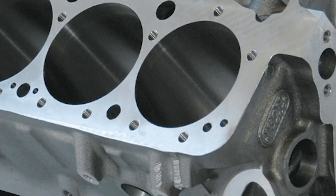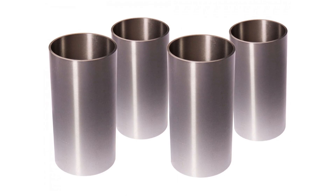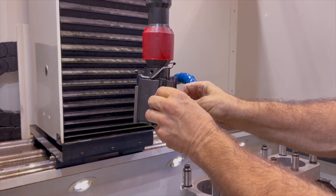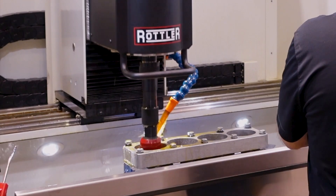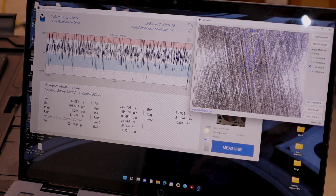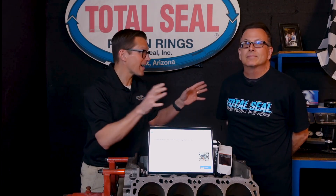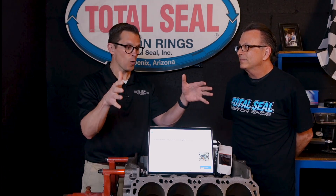We've seen it just last week. When you go from a cast iron block to an aftermarket sleeve, that change in hardness with the same abrasive, same load, same coolant — you can see that shift in how those valleys are forming and what those peaks look like. You can even see how it's cutting on the surface — those harder materials tend to want to smear more. So you really have to change up what you're doing. If you go from coolant to oil, all those variables we talk about — now you can begin to quantify the effects of those variables because you can see it.